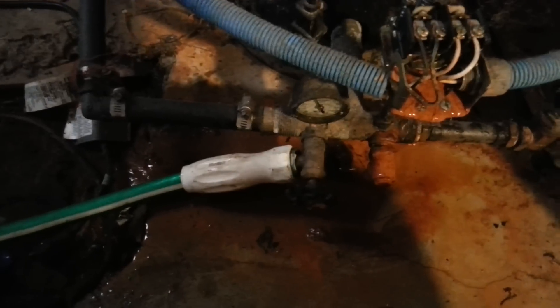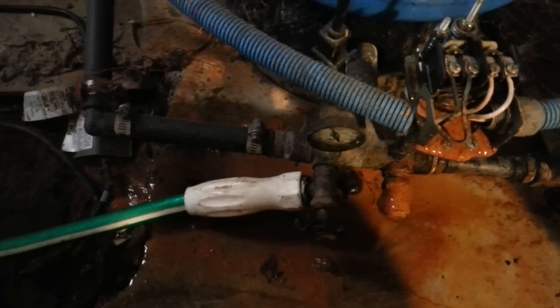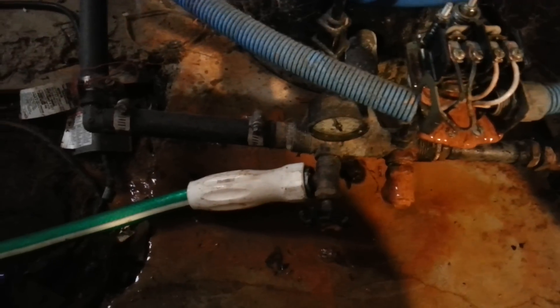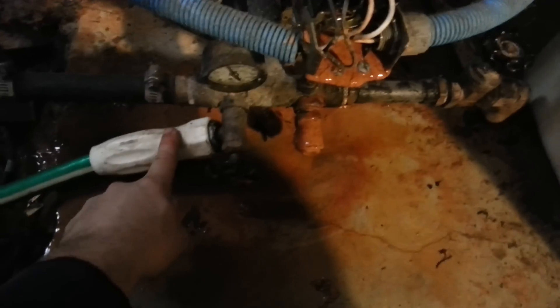We're going to shut off the well pump so no more water's coming into the house. Once you've got the water shut off and the well pump shut off so it's not going to pull any more water in, we want to pull all the water out that is in the line coming into the house, just so that when we take this thing off it doesn't flood my basement. So I just hooked a hose to this, ran it outside, and now I'm going to turn it on.